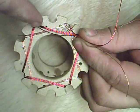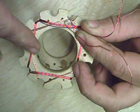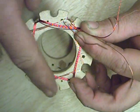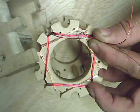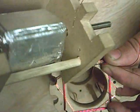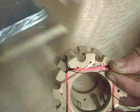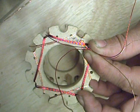So when you look at these actual phases, that's clockwise, that's clockwise, that's anti-clockwise, that's anti-clockwise. And same with that: clockwise, clockwise, anti-clockwise, anti-clockwise — which corresponds with the north-south poles of the magnets on your armature or your spindle. Of course, you just do the same with the next one, and that's all your three phases done.